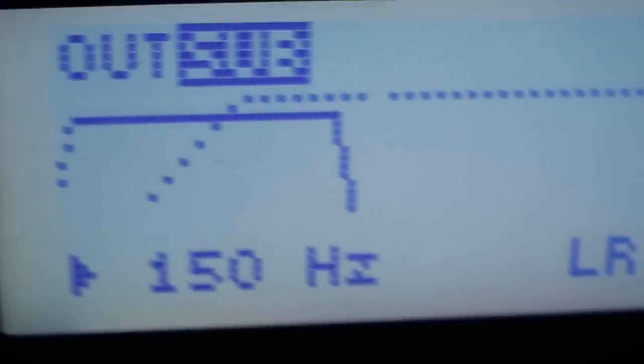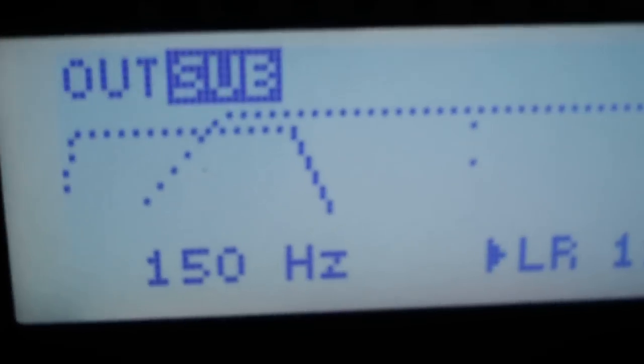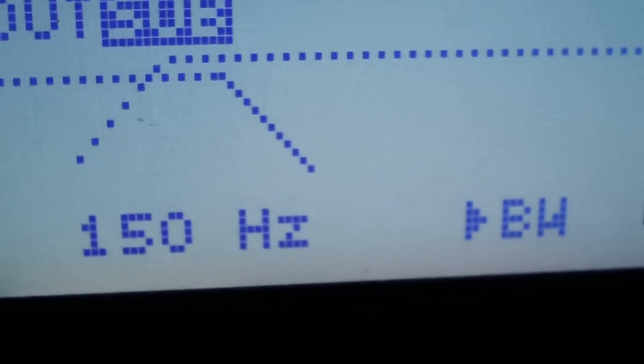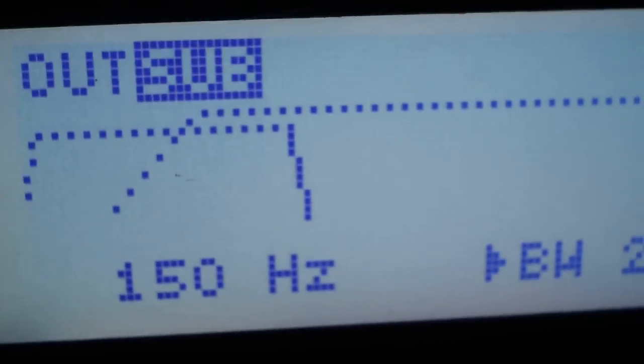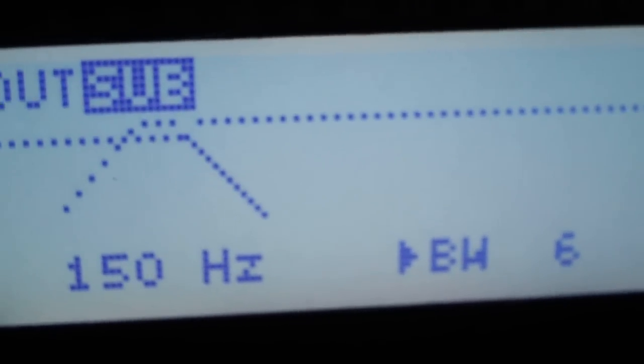For the other end, just hit the next page button — you get the other end of the slope right here and it says up to 150. Same thing, you press down the data wheel and look at your BW or LR — which I'm gonna look up — and watch the slope. The lower number, the smoother it will pick off from that frequency where the mains cannot pick up, and the subwoofer will pick up smoothly from those frequencies down to 20 Hz. The higher the number, the steeper it gets, meaning it will start hard at 150 down to 20 Hz. I don't know why they have LR in there — I just think it's the same purpose, I don't really see anything different or hear it sound different.